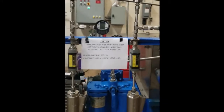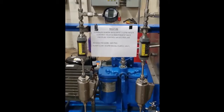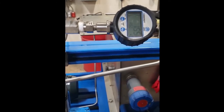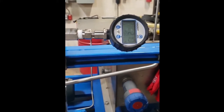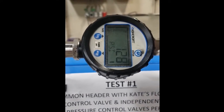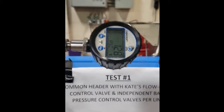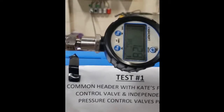Now for the magic of the valve. We're going to increase the pressure on one of these lines. The most important thing to notice here is that at 213 psi, we've only adjusted one line pressure, but the other line has still virtually remained very close to the initial 130 psi that we originally set. So that being said, we now have independent controls on both lines.